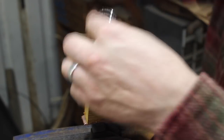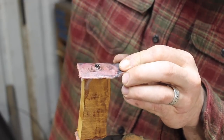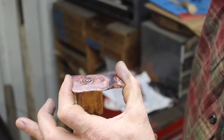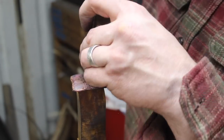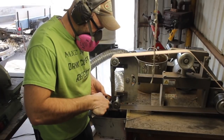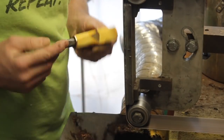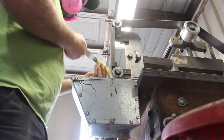Tapping this down, getting that nice tight fit with all the epoxy in there. Typically I'd allow the epoxy to set most of the way before peening down the tang. I decided to go ahead and peen the tang down so the whole handle assembly was tight before the epoxy set, to ensure a good mechanical fit without the epoxy — and then add epoxy strength to that. I did have to reheat the end of that tang briefly with the torch. It's not something I like to do, but 52100 will work harden more than something like 1080, and it did. I was able to get it down nice and tight before the epoxy set.